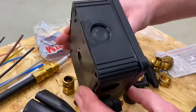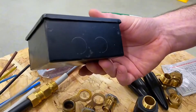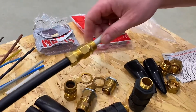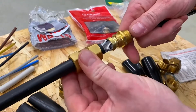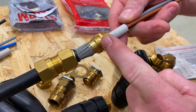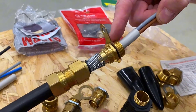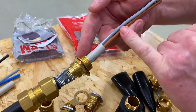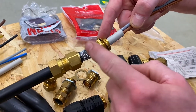Going back to the CW gland, a seal would need to be added by the electrician between the gland body and the enclosure — this is often forgotten. For outside use with an insulated box, holes are pre-punched. In college we tend to use galvanised or black enamel boxes. The armoring within the cable needs to be connected to the protective conductor. If using the steel wire armour as the CPC, it earths to the gland body, and the earthing ring brings the protective conductor into the enclosure. If not using it as a CPC, at least one end must still be earthed, as it is an exposed conductive part.